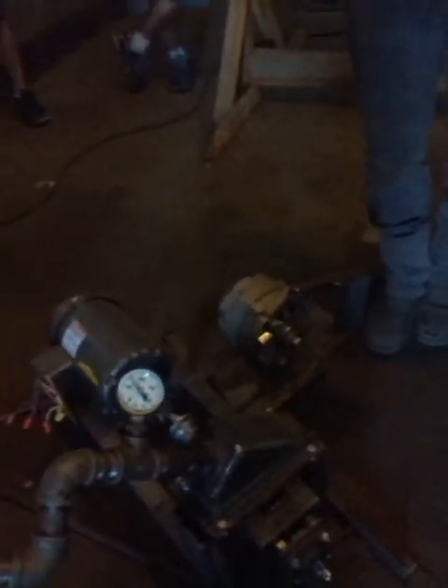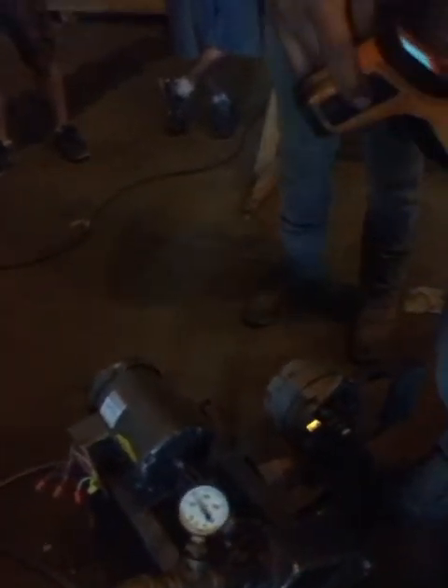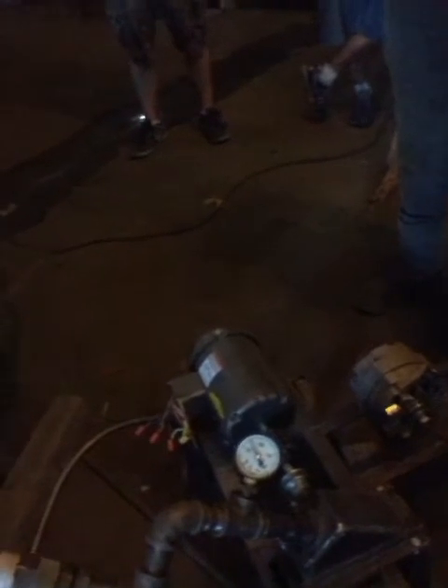That will happen until we actually get some temperature. As the temperature rises, we'll get more torque. Right now we're at about 88 to 115 degrees — no real temperature. I'm going to put the video on pause and let this run up to about 200 degrees. At that point, we will have two things this turbine needs to run: one is moisture, which we're developing, and two is pressure. But we require heat as well, and that is something you're not going to get with cool, dry compressed air, which is what Warren Rice used.